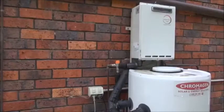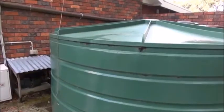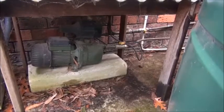We weren't really looking for anything that was going to operate cooking, electric kettles, or heating of any type. The only other consideration was that we've got several water pumps for operating our hot water system, which is gas and solar, and we also have a pump for our mains water out of the tank. That being said, 2800 watts more than accommodates that — not that all of those are operating at once.